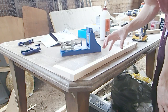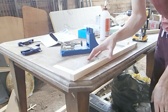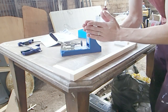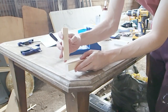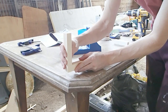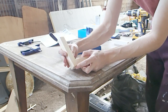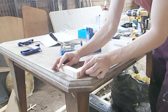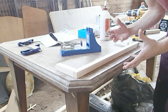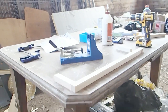This is a little bit overkill for just some real large boxes. You could just get something like a 12mm piece of plywood and literally butt it up against each other, and a butt joint is literally where you just butt it up like that, and then you could just glue it together, and perhaps put a screw or a nail through the other end. But because we're going to be using pocket hole joinery for our kitchen unit and also for the bed, it's a good time to show you how this works. So let me bring the camera just a little closer.